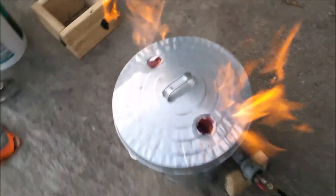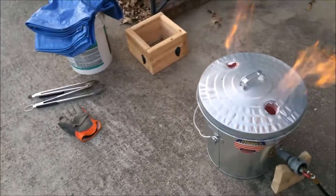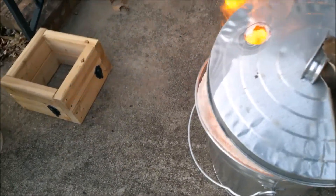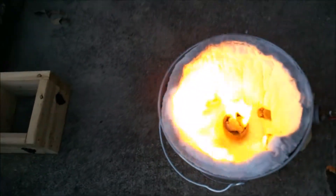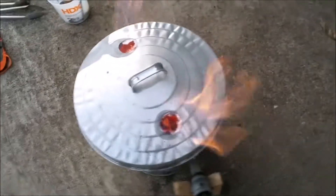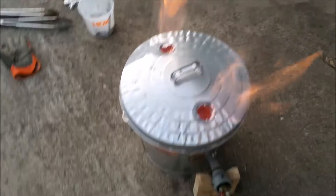I'm going to let it go just a little bit longer to make sure that aluminum is about to turn, then I'm going to set up these molds and we should be able to pour something tonight. Oh yes - look at that, that aluminum has collapsed! I cannot reach down in that vortex obviously, but that aluminum - yeah, we're pouring something tonight. I dropped a few more things in there - you can see that shiny stuff, that's the new pieces I just dropped in. It is liquid now. I lit this at 6:14, at 6:33 I pulled the lid off and it was liquid - 19 minutes.